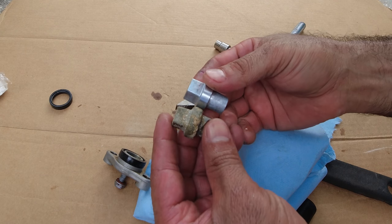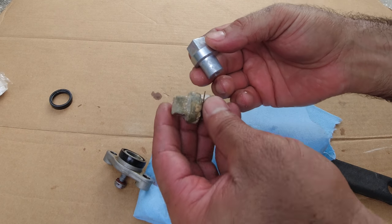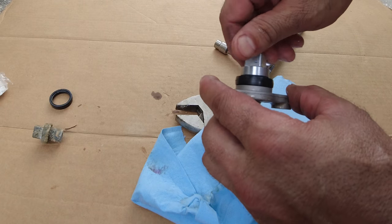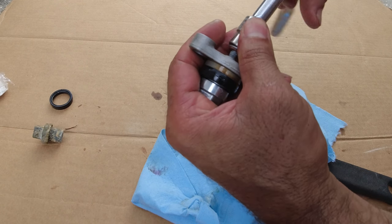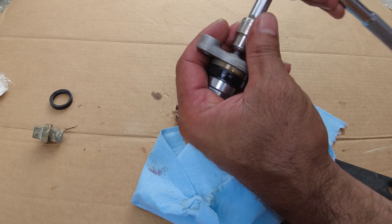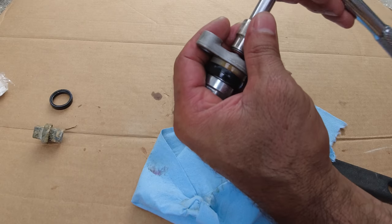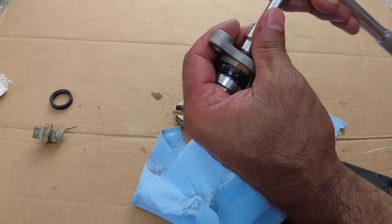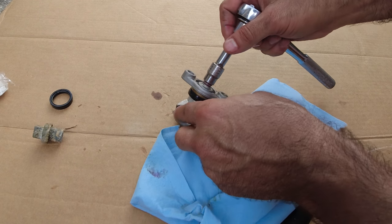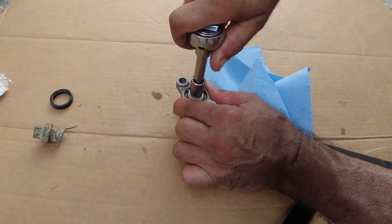As you can see the anode is not that bad at 250 hours — definitely not bad. I think 500 hours, like the manufacturer says, is ideal. But since I've been in a very harsh saltwater environment, I want to see what the conditions are, and once I see the conditions I just exchange it anyway to be safe. Now I don't have to worry about it for another 500 hours.